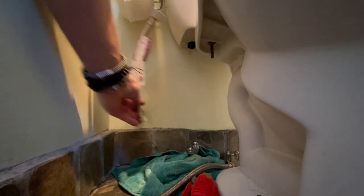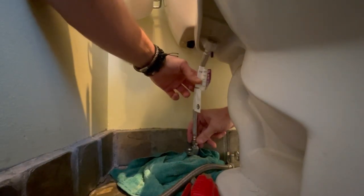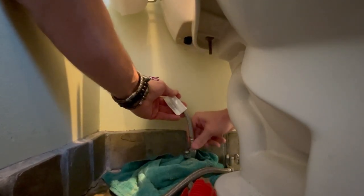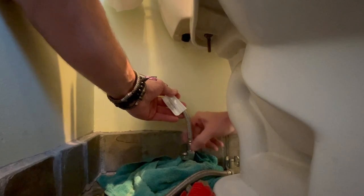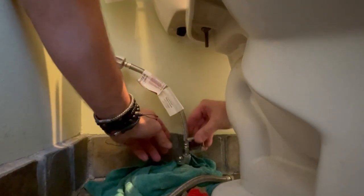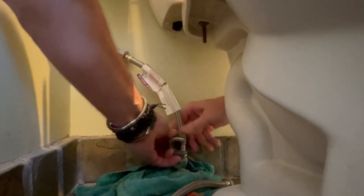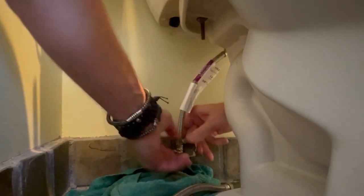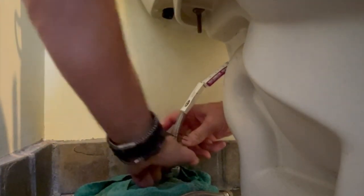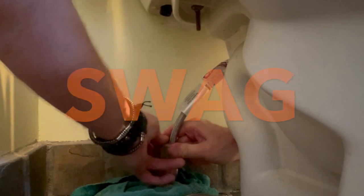I'm putting on a new 12-inch connector. Start the bottom nut by hand to avoid cross-threading — and why that nut first? Often the steel-braided line seizes onto the nut as it's tightened. Since the other end isn't fastened, you can let the line rotate freely as you tighten that nut. The other plastic end is much more forgiving and won't twist and choke the connector as it's tightened. And leave all those tags on, because swag!